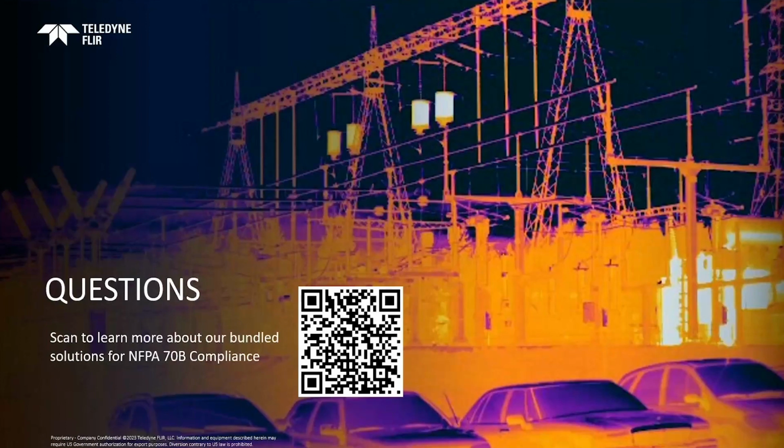Yeah, John, it's simply this. Covers have to be removed, whether it be a bolted cover, a hinged door, or a piece of Lexan or plexiglass that is inside the cover or door. Infrared needs direct line of sight for temperature measurement and developing those differences in temperatures. Now, because of safety, electrical shock, and particularly electrical arc flash hazards, sometimes opening a piece of equipment, if the arc flash hazard is high enough, can be prohibited or considered to be a bit too dangerous or unsafe.